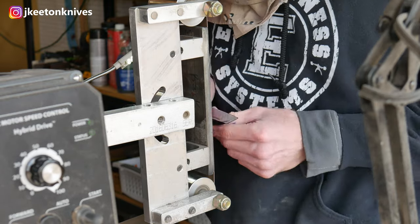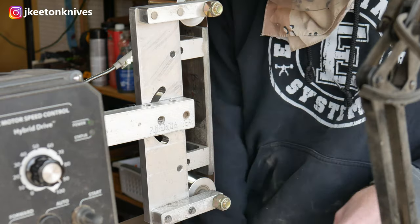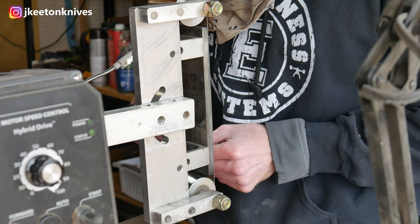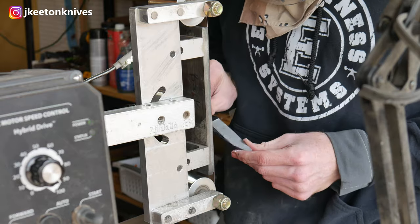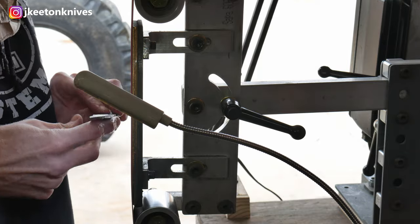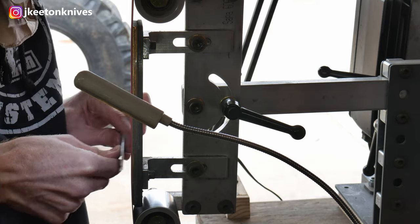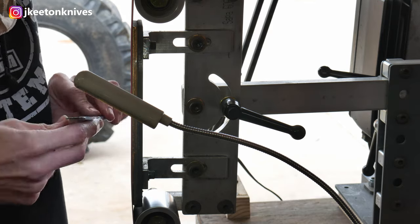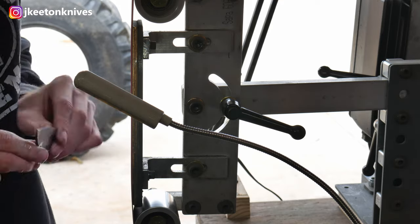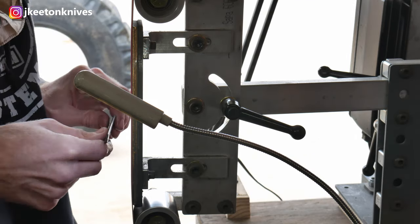You see me working one side here. I'm slowly putting pressure towards the spine of the knife to work that bevel all the way back. I'm about to show a different angle where I switch to the other side to get that bevel work back as well. Notice that I'm using my thumb to apply pressure with my right hand, and I'm slightly pulling my left hand back as I get closer towards the tip. I've seen a lot of different methods online and I think I'm going to try a push stick method soon. But so far so good with this method.